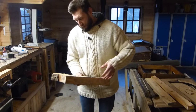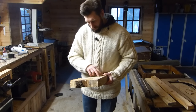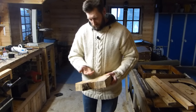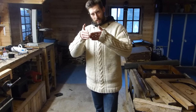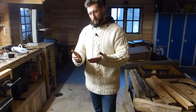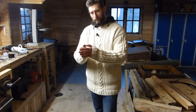Now, I had hoped to get a breast hook out of that, and I still think there is a chance of getting a breast hook. At the moment, Idler has one breast hook on the gunwales where they meet the stem head, and the bilge stringers, they run in, but they are just sitting loose at the end. There's nothing holding them together.